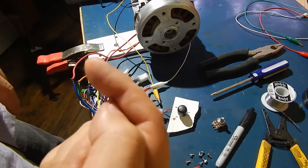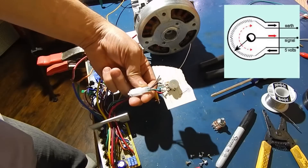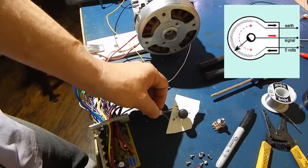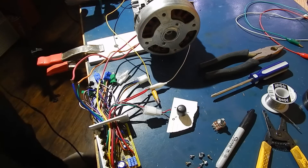On the video on this side I've left a picture of how you can wire that up if you want to set up something without a hall sensor. You can use a pot — you just have to make sure you zero it out before you turn it on. But I will show you how it works.